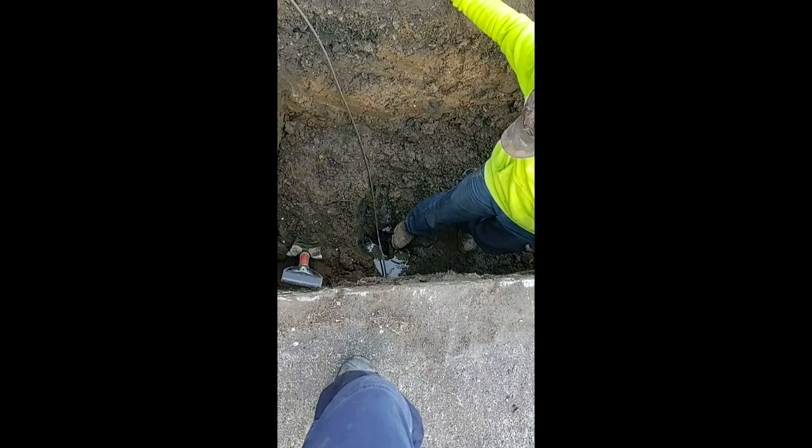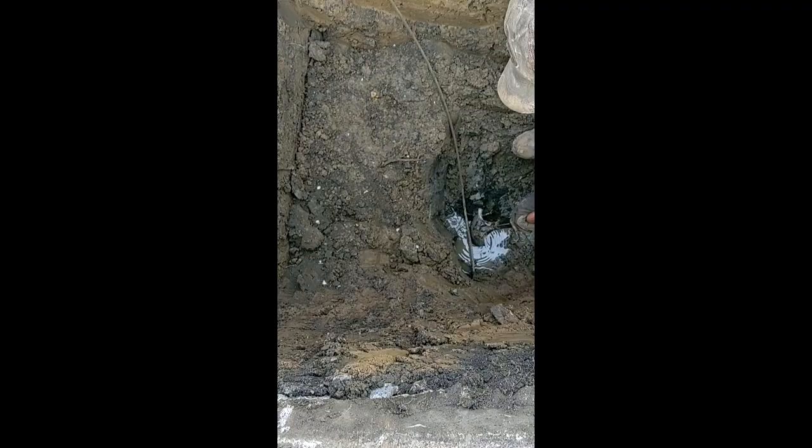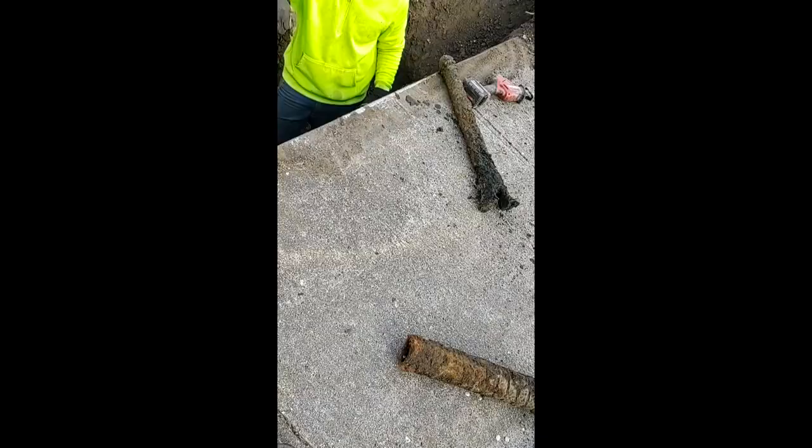This is out on the street side, opposite from where I was in the basement. I pushed a cable through, they cut the line and pulled it out, then it attaches to the excavator for a tug. I'll go back into the basement shortly and show you what it looks like as the cone/wedge head gets put into the old galvanized line and blows it apart — basically slices it clean open. It's a pretty cool process when it works.